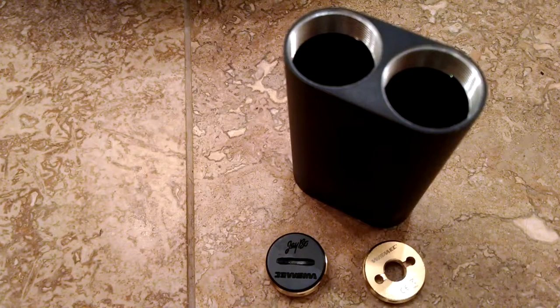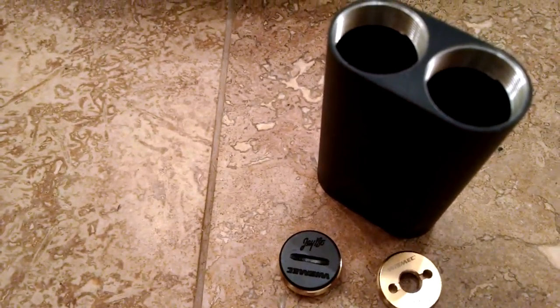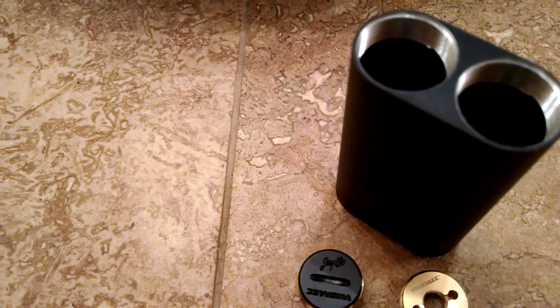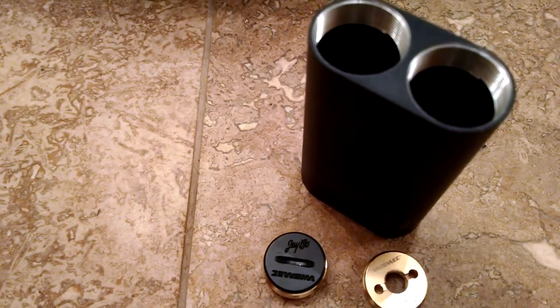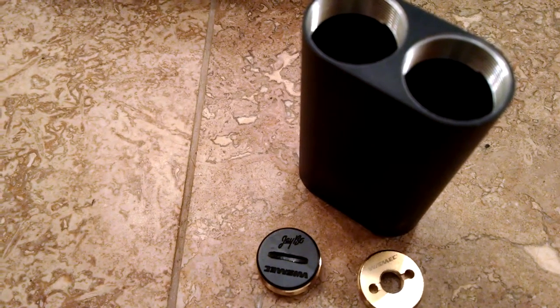They're a little dirty. Okay guys, back to the safety issue. Once again, this is a series box mod, meaning these batteries are not parallel, they are in series. So you're getting a full 8.4 volts out of this when your batteries are charged. It's not regulated, of course, it's mechanical. But safety folks, safety first, okay?